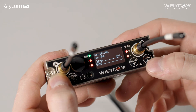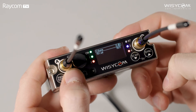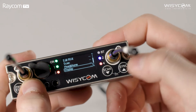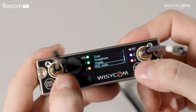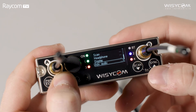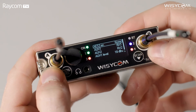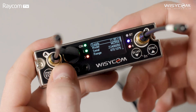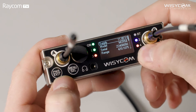Headphone allows us to select which channel we want to listen to via the aux output on the front and also adjust its volume. Display allows configuration of MCR54 display settings such as brightness. Advanced Audio allows finer control of the MCR54 outputs depending on the backplate or slot-in we have fitted — with a BPA54 attached for example, it's possible to enable AES outputs on the aux top feed or on the main base outputs. Lastly there are settings for the activation code and panel lock. The Info menu gives us details such as the current backplate fitted, hardware and firmware details, and also lets you review any alarms that have occurred.